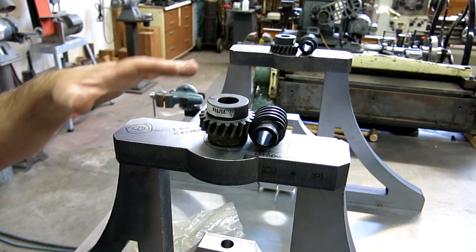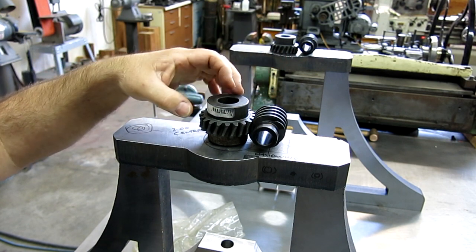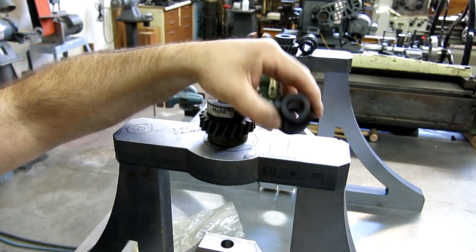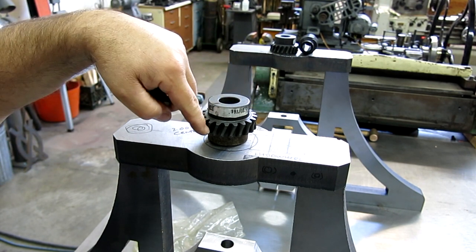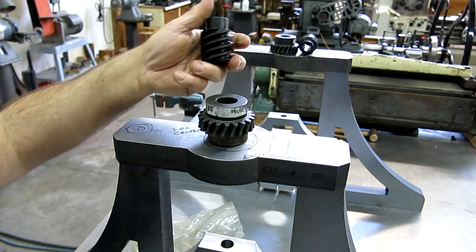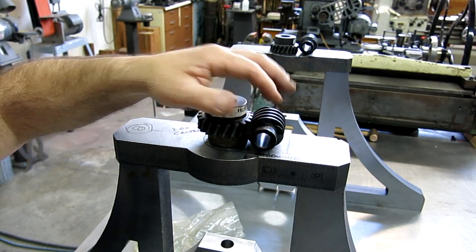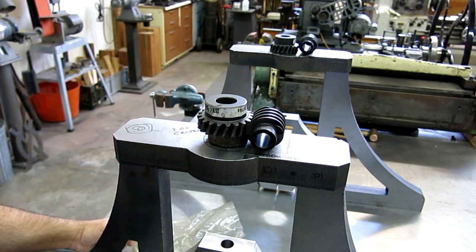Here's the top section — we can see we have a little worm gear set. Originally I was going to actually make these worm gears, but after doing a bunch of calculations about how many turns it would take to lift this, I ended up having to buy them. This is a four-start worm with a matching gear. I don't have the ability to cut those in here, at least not at that pitch — my lathe doesn't have a coarse enough pitch to cut that thread. So I decided to buy these; it saves a fair amount of work.